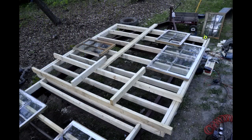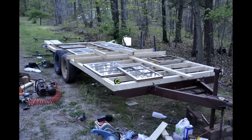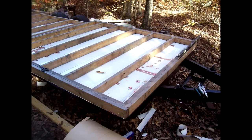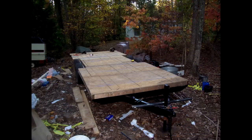All this was sort of during the design process. I call it an active design process where you're designing and building at the same time. I was lucky that the travel trailer had a full-size sheet of aluminum underneath the entire structure so I reused that on my tiny house underneath the subflooring. I patched up all the holes with foil tape and flashing, then insulated the floor with R13 fiberglass insulation and used 7/16th OSB as the actual subfloor sheathing.